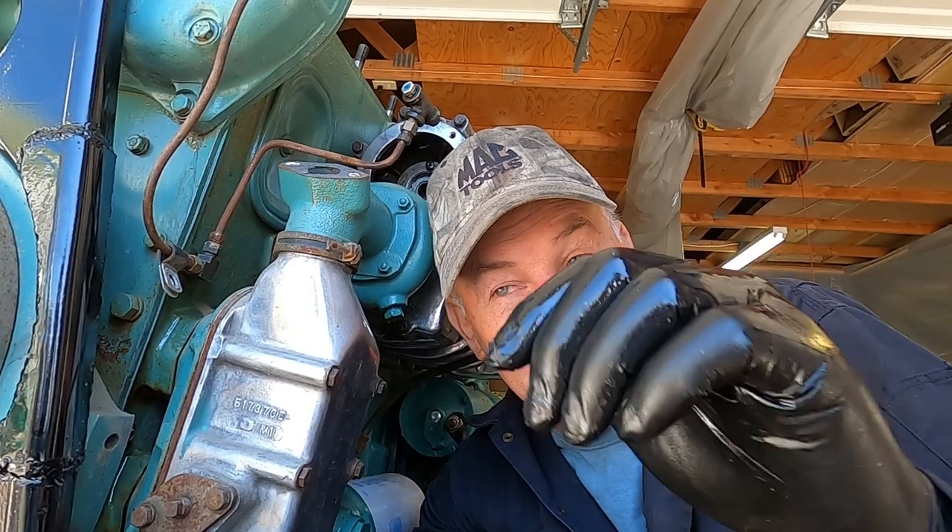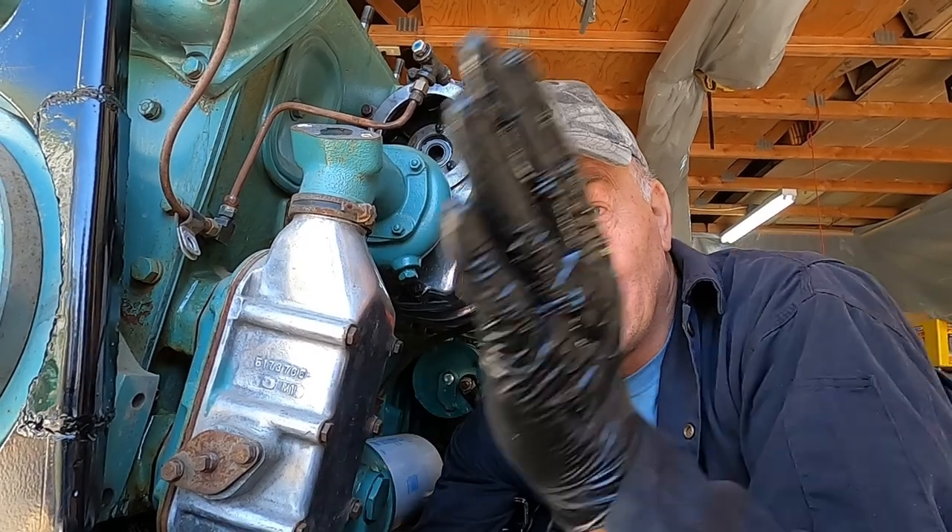When you take it apart, you identify what you've got to work with — pistons, head, everything. Once you figure that out, you can proceed. When you're taking the liners out, if they come out nice and easy, that means the block is pretty straight. If you have to beat them out with a big hammer, you're going to have trouble. On that boat I did in LA, there were two holes that were twelve thousandths out of round on a four-inch hole, so the pistons couldn't keep up.